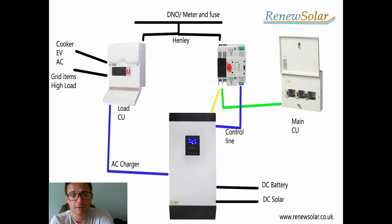The ATS side and the circuits within your home can be done by yourself. However, you need to make sure you're not changing any fuses, that your lines are capable of providing that power, and that your peak usage doesn't exceed that of the inverter. The inverter will switch over — either going on pass-through if you have one with pass-through — or it will switch over at the ATS and you'll be running back off the grid. So like an eight kilowatt shower and a five kilowatt load combined: rather than the grid sharing the load, you may find the inverter switches off and goes back to grid, then resumes after.